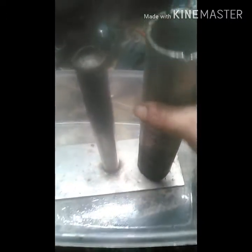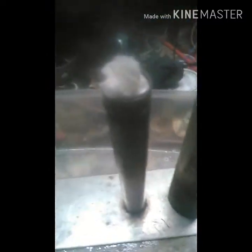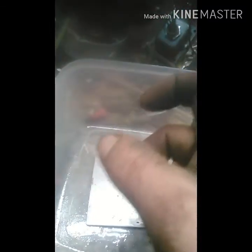All right, so here's my retort. It's just stainless steel — a tube with a cap on one end, and I cut a couple little notches on this end. There's a little dish on a stand. You put your amalgam right there, then you take this and it goes over the top like that. Say you have your torch on the left side — you're going to want this on the opposite side so you heat up right here, closest to the stem on the inside.